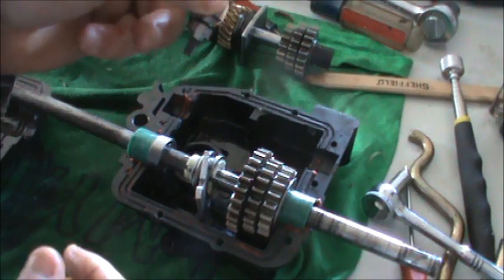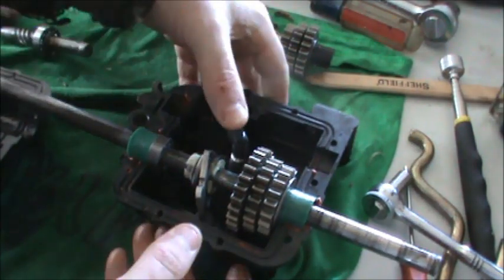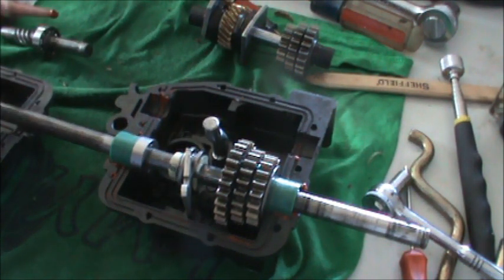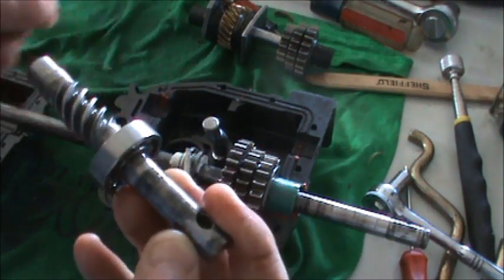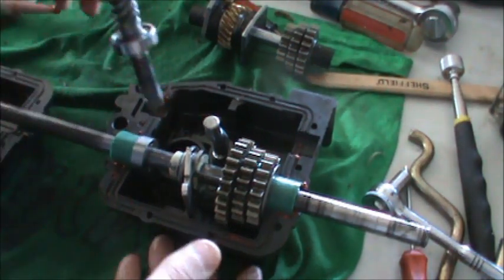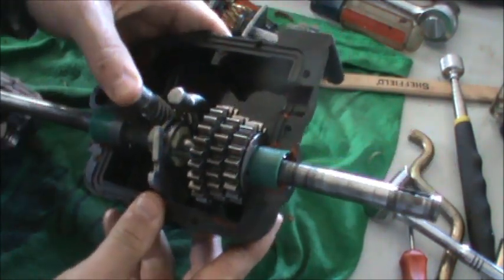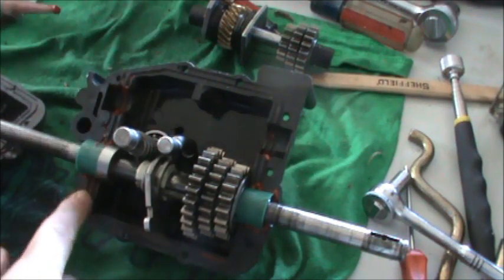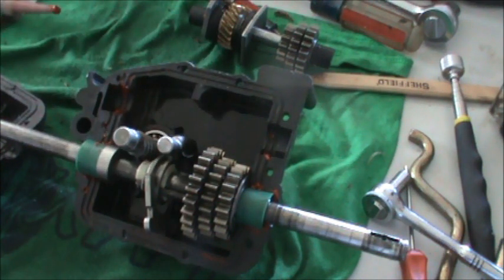The next thing is to put this curved plate in so the curve goes away from me — that'll lock in good, and there's a nut that goes on the back of that. Then I want to drop the worm gear in here. It's going to slip in — I already put the bushing down in that hole — so we'll slip this thing down. Now I want to run RTV sealing around the whole case, then drop in the gears and seal it up.